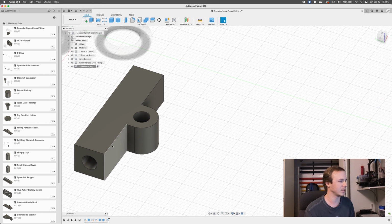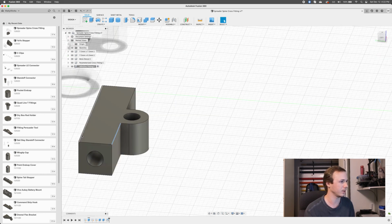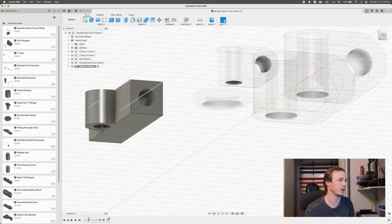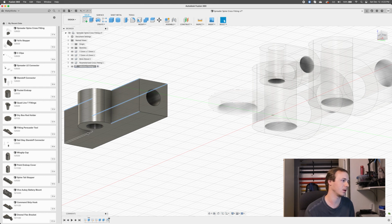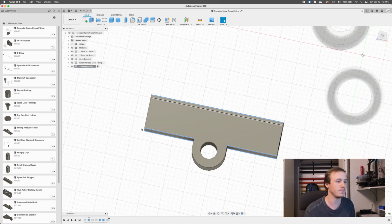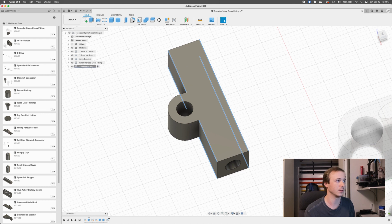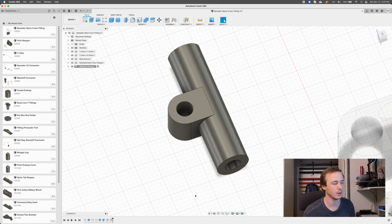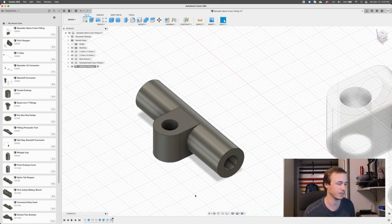And then we want to do the same thing with these guys, but based on the spreader diameter. So I'm going to grab all these corners, grab this guy, and this guy, and this guy, right? And again, I'm going to bevel. So let's bevel. And we're going to make that be spreader diameter plus spreader wall. Oh, I don't want to put parentheses around this. Spreader wall times 2, divided by 2. Boom. Cool, right? That's looking more like a thing.